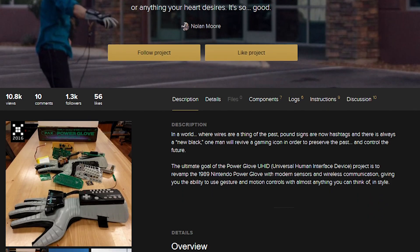Before we go any further, I want to give a huge shout out to Nolan Moore over on Hackaday.io. He originally did a project very similar to this — in fact, I'm using his PCB files with some of my own modifications. His project used an ESP8266 Wi-Fi module that some of you may be familiar with. That's great and all, but I intend to use this at DEFCON, which is not exactly a sane environment for that kind of radio system. Even the 2.4GHz of the NRF module I'm using isn't ideal, and I intend to swap that out with 900MHz — making it a little more obscure and less likely to be sniffed, messed around with, or interfered with.